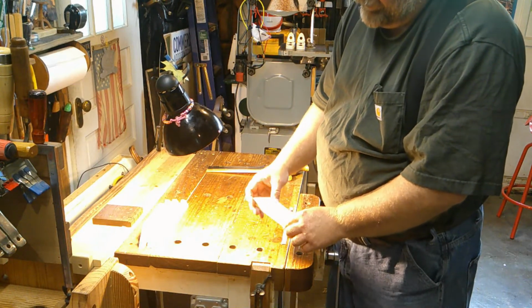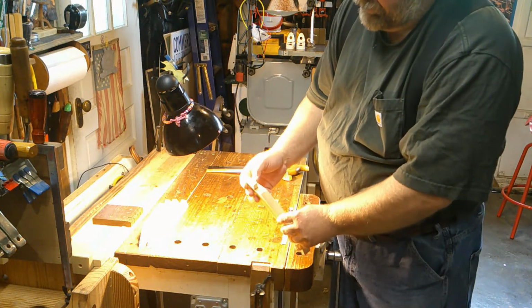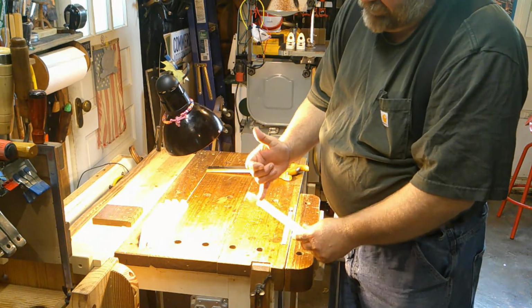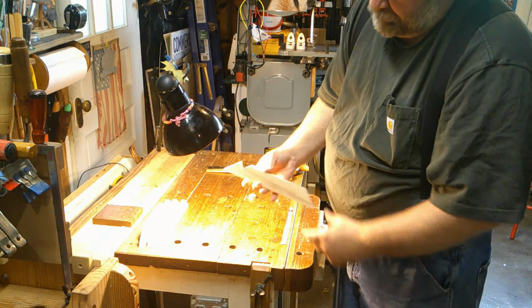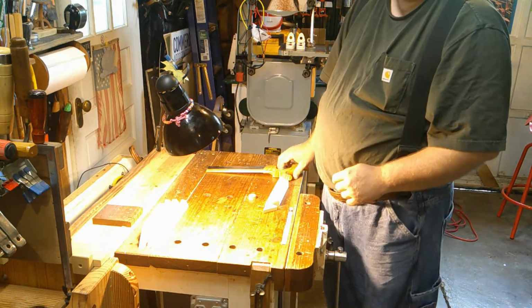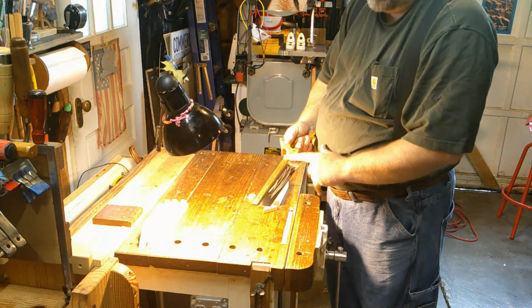But we also got to lay out the dovetails, and we not only laid them out, but we knifed in knife marks, and I've been sawing. So we'll saw part of this away and saw this for the shoulder, and then make this notch for our dovetail. When we do this, I'll show you how to do it. Since most of these are partially rip and cross cut, I'm going to use my dovetail saw.